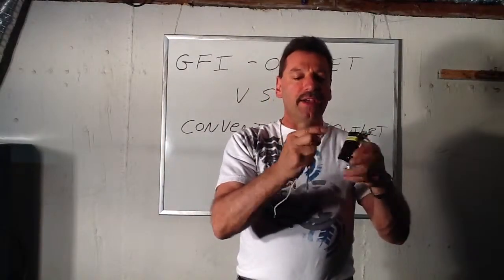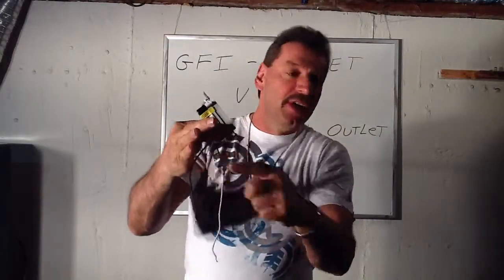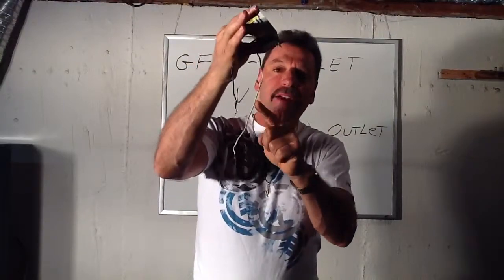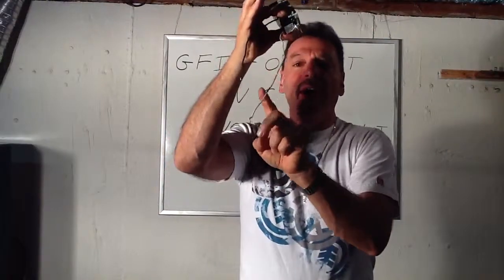A GFI also has two wires going to it — a black hot and a white neutral. When you start using this outlet, it detects the current. If you turn on that egg beater and you start to use two amps, it detects two amps going and the current going back — it's always a constant. If for some reason you started getting electrocuted, the electricity from the hot would be going here, but instead of going back through the white return wire to the panel box, it would be going through your body into a different ground — probably because your feet are in water or you're grounded. Once it finds a different ground back, this white wire has no more return current going through it, and this knows that because it's not constant anymore, and it immediately shuts off.